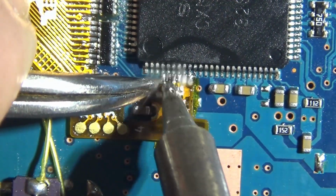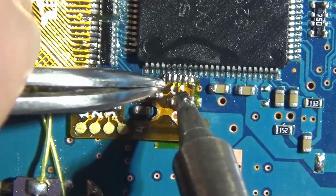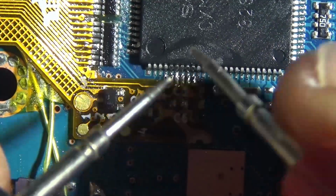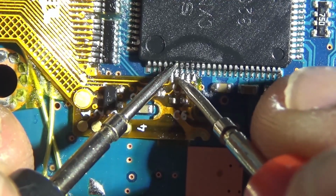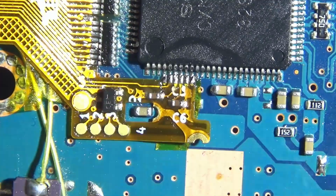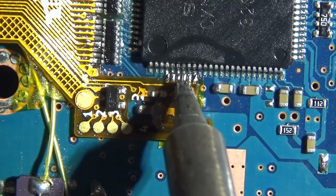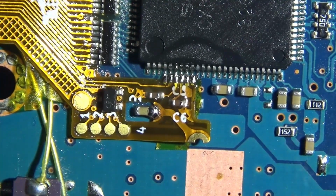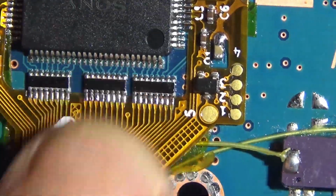Yeah, I remember I struggled with this side. With the alignment, Kapton on the capacitor, etc. So when we get to the V10, that'll be my second one, and you'll see how I've optimized the install by quite a bit. And for continuity there, I was touching the base of the pad on the flex cable to the top of the pin, and I used very fine multimeter probes. So super duper fine. It's very easy to touch a small pin like that precisely.